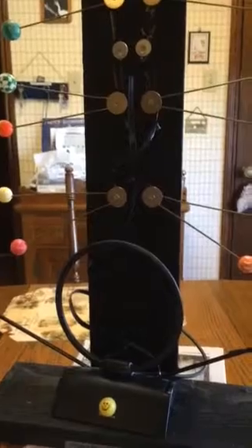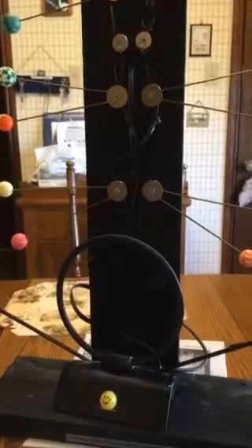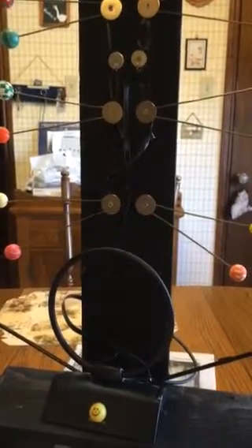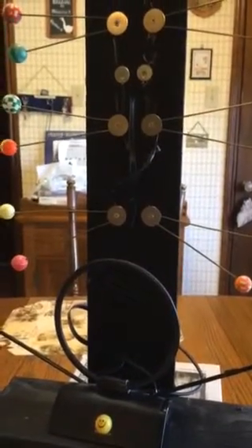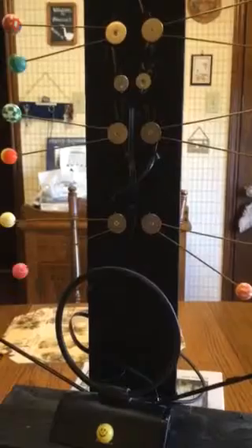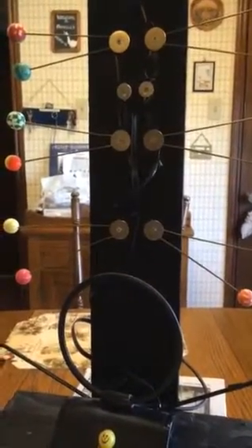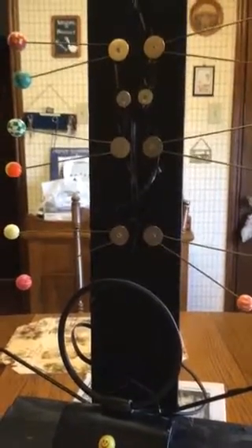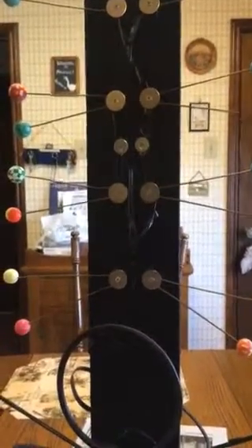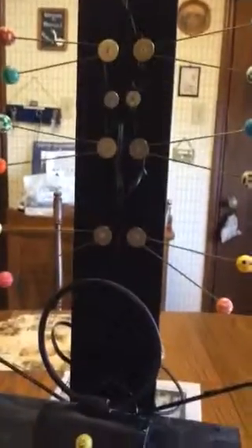Because with the digital system you get channel 4, channel 4.1, channel 4.2 — all these sub-stations came in high-def. I was really surprised. The key is to dress it up and make it look nice so you don't have to hide it, because the higher you put this thing in the house the more you're going to pick up. I had mine sitting on top of the fireplace mantel — elevated, prominent location — and it actually works. Use a shiny washer and put black tape over the crisscrossed wires to make them blend in with the black paint.